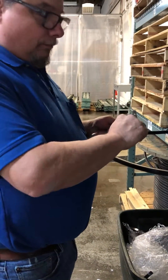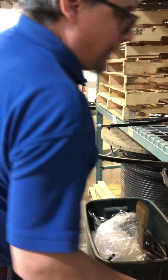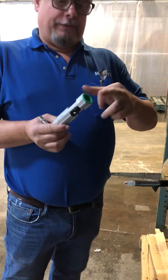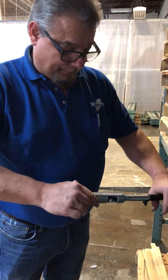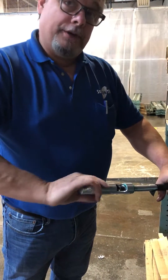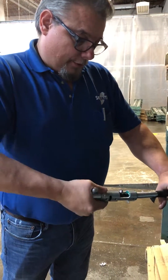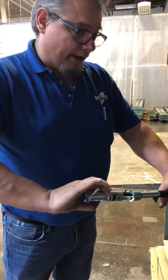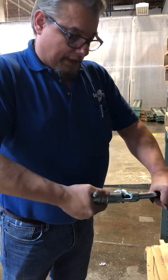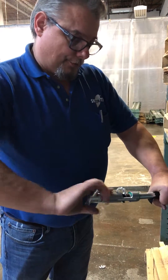This is a Cable Matic — for this kind of cable, the Cable Matic is probably the best one. You can identify the 750 by the green insert. Using a Cable Matic coring tool for 750 P3, the three-quarter inch. The 750 MC-squared that has fused disc plastic dielectric takes a different tool and different connectors — completely different equipment.